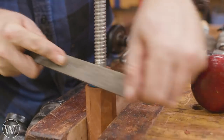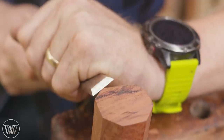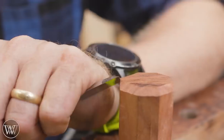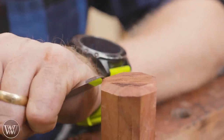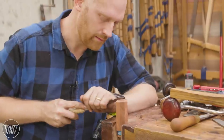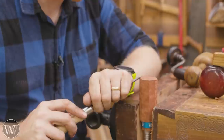Not the best thing to use, but it gets it down there. We're going to chamfer off the very edge to get a nice clean chamfer, and do the same on the other side. One thing I did like about the red gum is that it chisels really, really nicely — a very clean, smooth cut. You can chamfer the corners with a chisel very easily, and it was a pleasure to do that step.